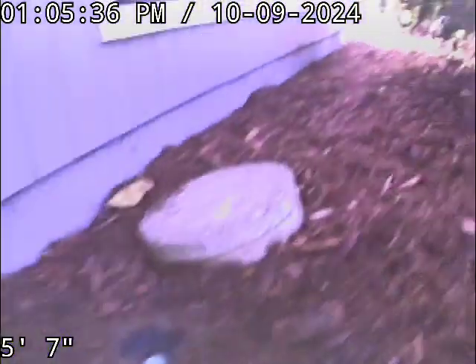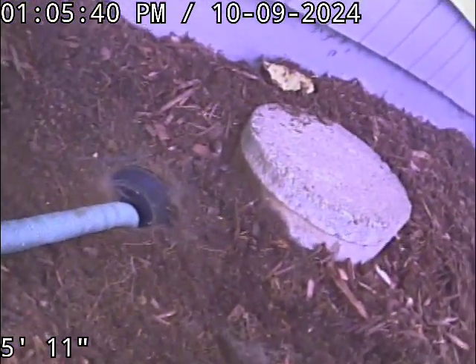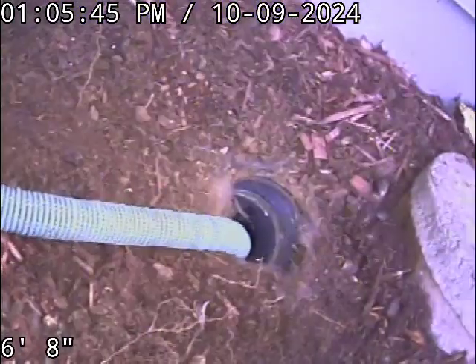You've got a good landmark to go off of here. The sewer line comes out of the house right next to the water shutoff where the main water supply comes in. It's just a few inches to the left of the little concrete lid there. We've got a three-inch ABS clean-out. We're going to check the overall condition and serviceability of the sanitary sewer line.